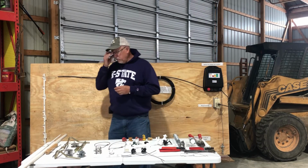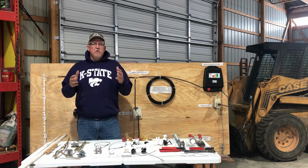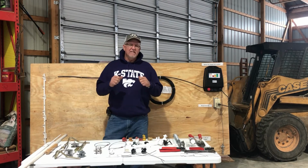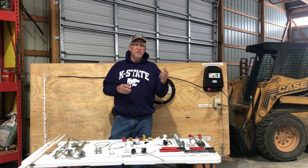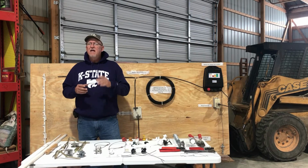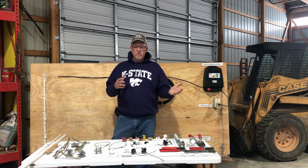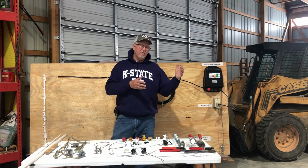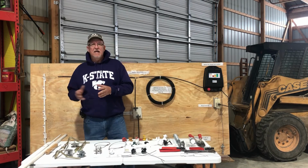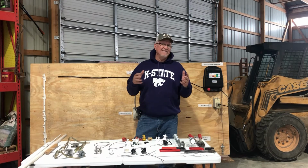And when you build permanent fence, we want to think about using high tensile wire. High tensile wire is very, very stiff, and we prefer to use the 12.5 gauge high tensile wire. We want to make sure, as we've talked about in the past, that it's class 3 galvanized. And then there's wire strengths that vary from anywhere from 170,000 psi to 210,000 psi, and the wire that's under 200,000 psi is going to be the easiest to hand tie.